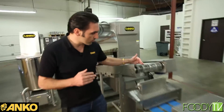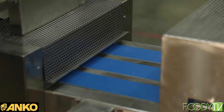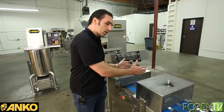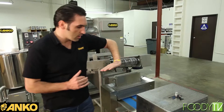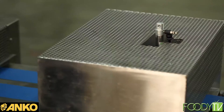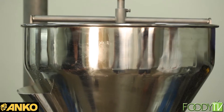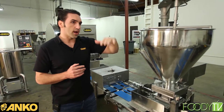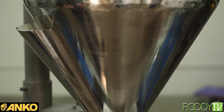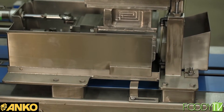As we proceed through, we have the cutting station here — we're going to have a cut pastry and push it through the line. Then we rotate it so it's diagonal. Right now there's a square pastry proceeding through, and because of the way we want to fold it, we rotate it diagonally. We have a rotation piece that pushes the pastry through at a diagonal angle. This is our filling station. The filling hopper is very generous — we have a pin inside that continuously drives the food down, so we're generally able to handle almost any filling.